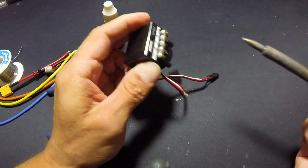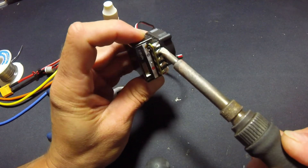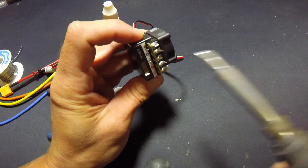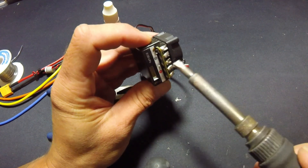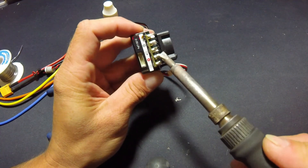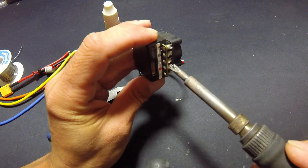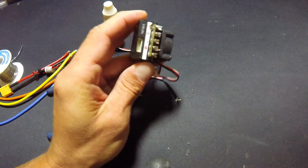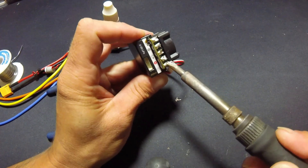To get some of that solder out — obviously we're not gonna hold it upside down — you can do sideways as well. The sideways technique: you just scoop a little solder out on the end of your iron. You don't need to get it all out because you're gonna need some of that remaining, but for the most part you can get a bunch of it out so you don't have all this extra solder floating around wrecking your day.